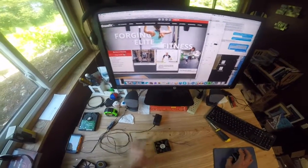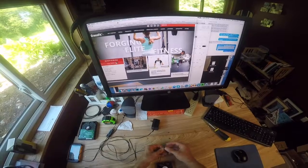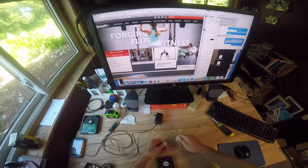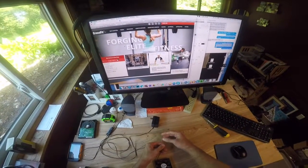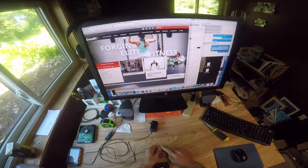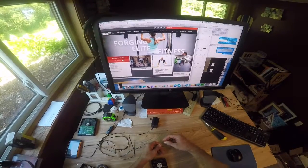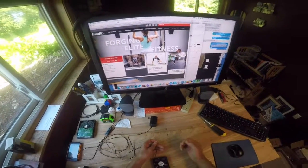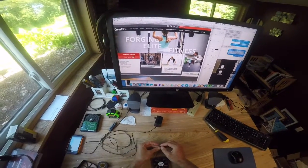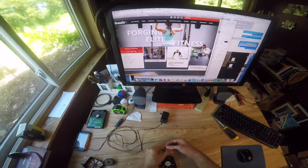And so once you get it all cleaned up, if your fan has 3 wires on it, the red, blue, and black, the black is the neutral, the red is to provide power to the fan, and then the blue wire can be used if you have a way to control the fan speed. So that's what you're gonna be using. Since we're not controlling the fan speed, we just want this to run. I'm gonna fold that back